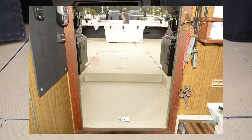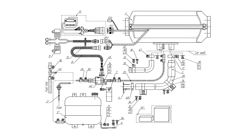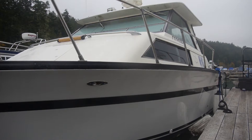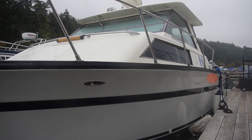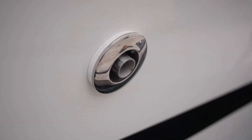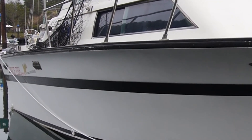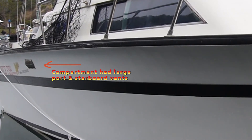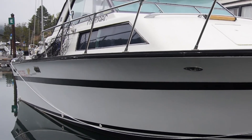Aft of the heater compartment was another compartment containing storage and fuel tanks. The forward bulkhead of that compartment was where we decided to install our diesel fuel tank. Exhaust outlets and fresh air inlets should be mounted high on the hull or superstructure to avoid possible water flooding to the heater. This boat has good freeboard and the upper part of the hull was accessible. The heater compartment had excellent ventilation, so no further exterior intake venting was necessary.